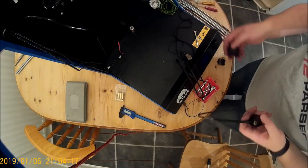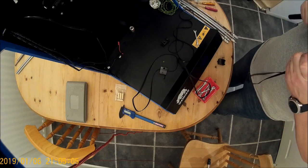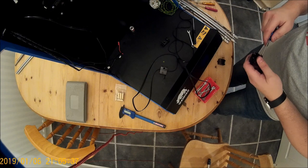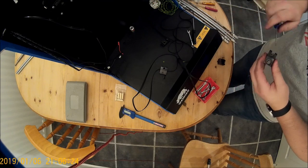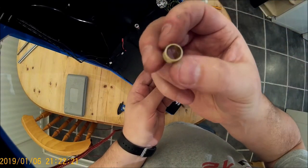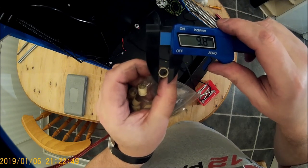The sliders are either clamped to the belts with little brackets, or for some of them, the belt runs through the middle of the bearing block. These are the blocks that have the bushings in that I need to replace — they just have four screws. I've pressed out the bushings; these are the actual bushings that were inside those bearing blocks. I want to replace them with an oil-lite bearing — a much better quality option.